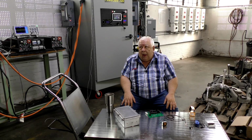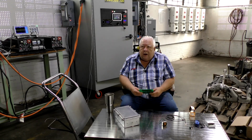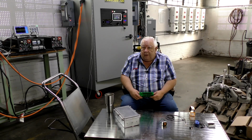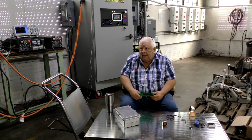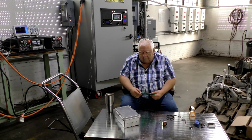And so your active or true power would be, the current would lead the voltage. A capacitor resists a change in voltage, but can produce a tremendous amount of current. An inductive load, the voltage leads the current. And that's more commonly what you'll see, because all your fans and blower motors and so forth are really an inductive load. And so when you apply a voltage, those inductors, or those windings, resist a change in current flow, and so your current lags a bit your voltage waveform.